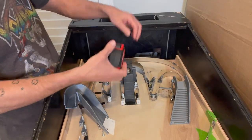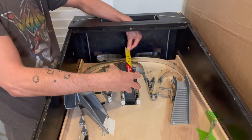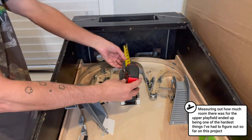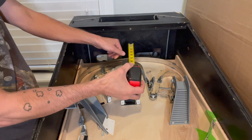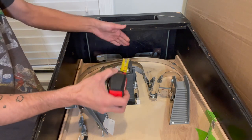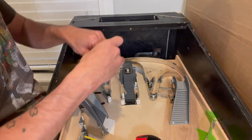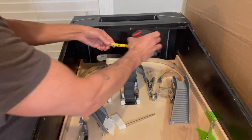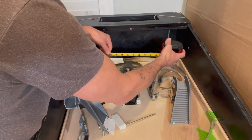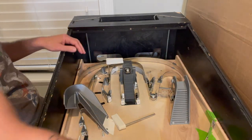Some things we need to understand — just how much depth do we have? From the back wall of the playfield to the back edge of the steps is right about five and a half inches. We probably need about a half inch of that clearance for the steps to curl past, so we've got about five inches deep for a playfield. For width, we can put the bats on either side of this horseshoe, and we're looking at right around seven inches minimum width, possibly as wide as nine to ten inches.